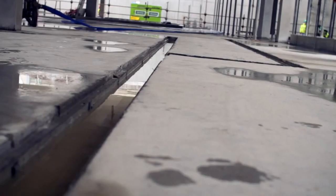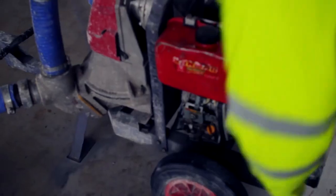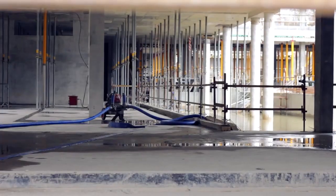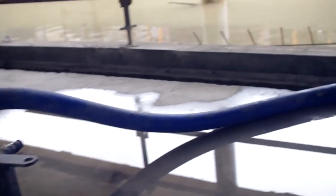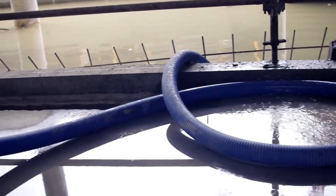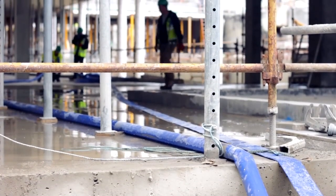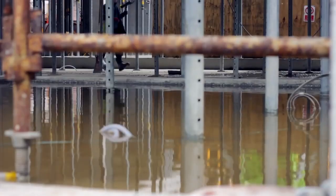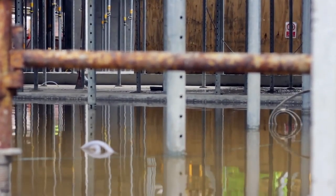The site itself is beneath the ground water table so it does mean that we get an ingress of water. In order to deal with that we channel the water into a settlement tank. The water goes through a series of filter media in order to settle out any suspended solids. The discharge of that water is covered under a discharge consent which we obtain from the Northern Ireland Environment Agency. So we monitor the quality of the water in line with the consent conditions issued by NIEA. The conditions include no visible oil or grease, pH needs to be between 6 and 9, and there needs to be no suspended solids — less than 50 milligrams per litre.